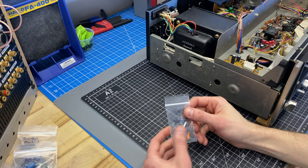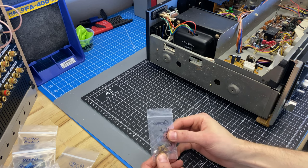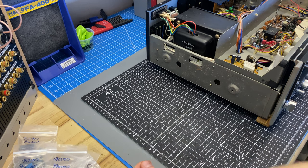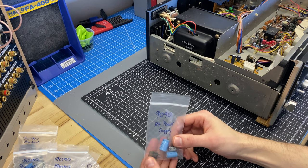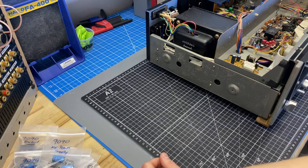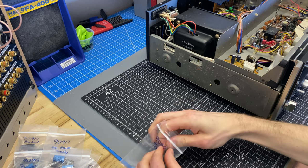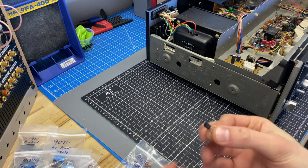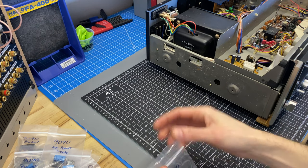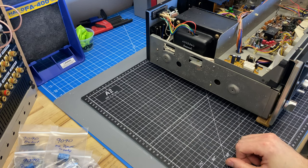These are just some of the lamps I replaced. For the phono board, same thing — some of these low-leakage orange caps. The RF power supply was completely fine; I just replaced it because these pass transistors dissipate a lot of heat over time, so that was just preventative maintenance. The tone circuit had some black leg transistors — these tested fine, but they're a known troublemaker. I believe that's 2SC1313 — I've had these cause issues on Pioneers before. Overall it was basically just a preventative maintenance rebuild to get this thing extremely stable and aligned.